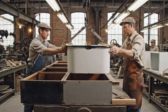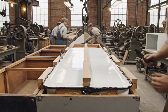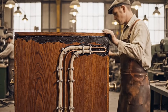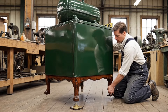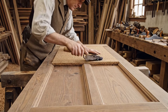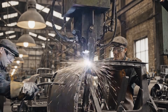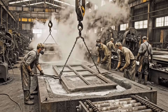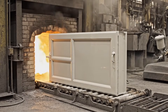The enameled liner is carefully lowered, ensuring the crucial insulation cavity is maintained before the seams are expertly caulked. The final stage of assembly ensures the cabinet is fully insulated and sealed against the elements. The complete door assembly is processed through the alkaline clean, pickle, and nickel flash sequence, ensuring a matching porcelain finish.